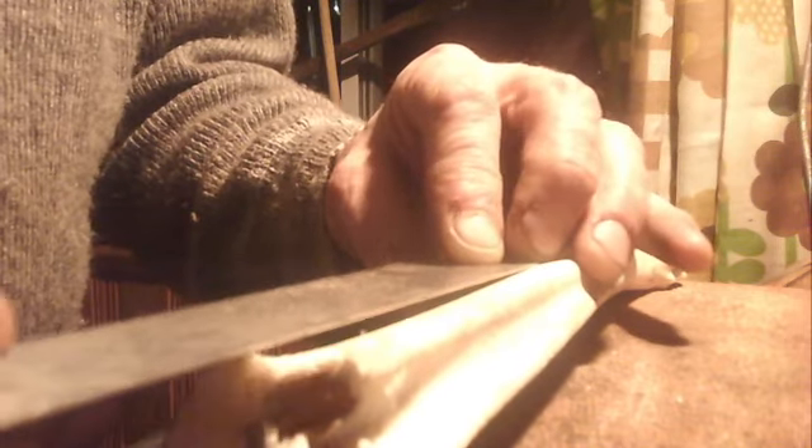We got 9 right there, so from the edge — I think I want to go a little bit away from the edge, I'll give us an extra eighth of an inch. The sweet spot on a guitar is no higher than a half inch, so if I calculate that down, I'm gonna go for one eighth above this, so it's about an eighth in and an eighth out — we'll go for a quarter inch.